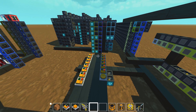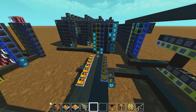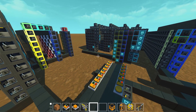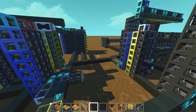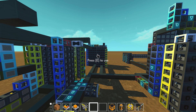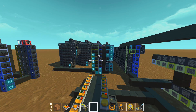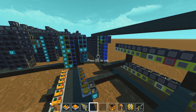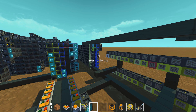I have it handling operands right now. Each instruction is formed of one opcode which correlates to the first four bits being a module and the second four bits being an action that the module can take, such as incrementing, pushing onto the stack, or taking a value from the IO bus. I have it set up so that all general memory presented to the accumulator is not considered separate modules but an extension of the ALU, so the only control code any memory takes is addresses directly from the accumulator — meaning memory can't have special functions unless you customize the module, because usually they don't need special functions except for the stack.